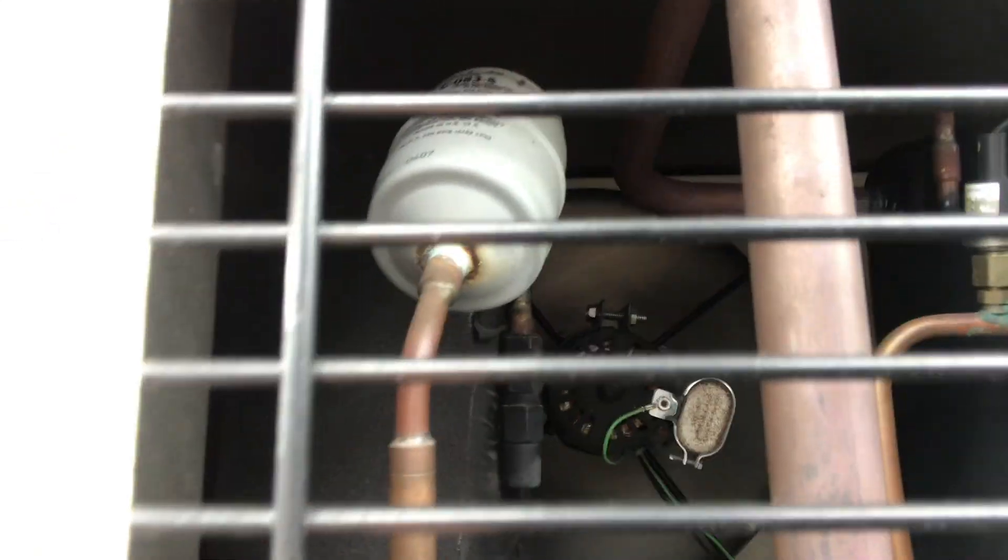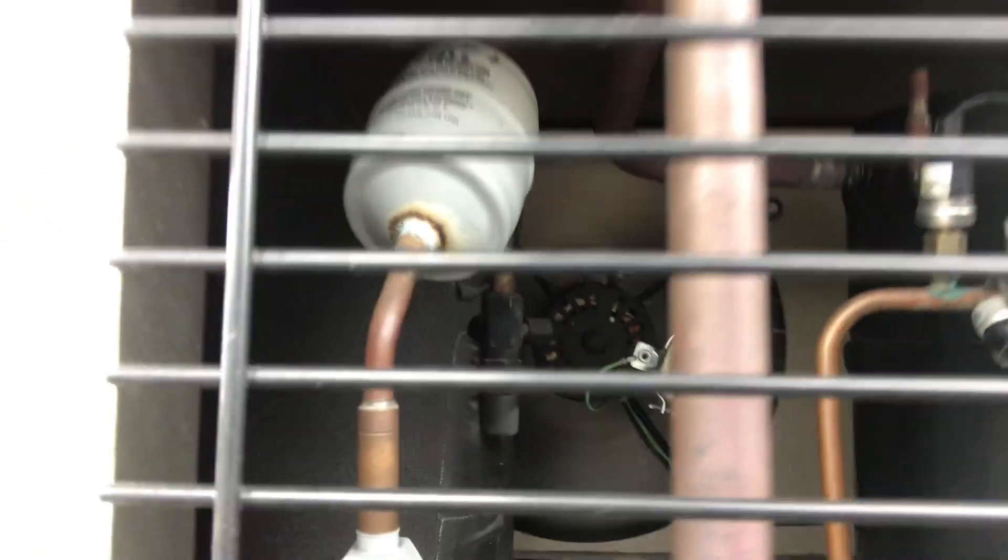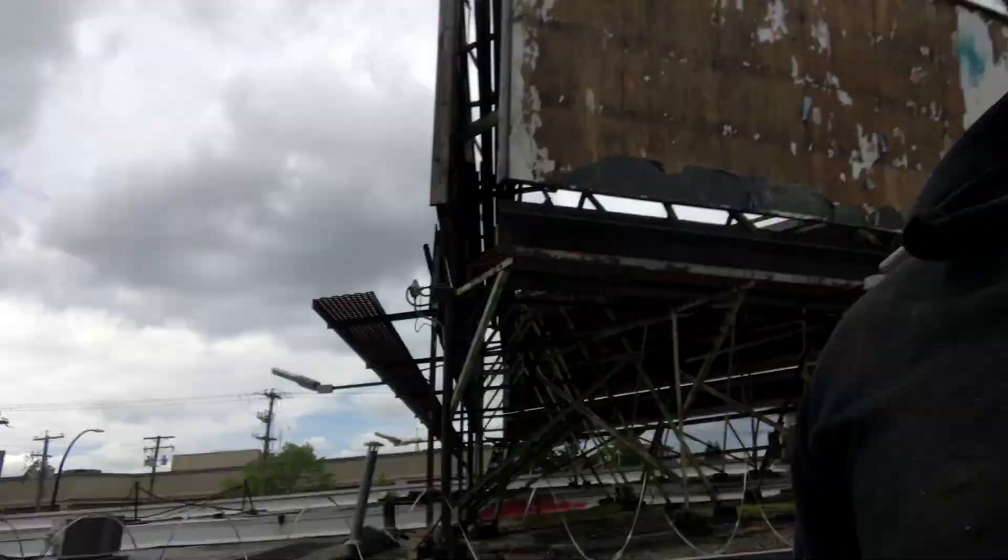We're going to be using it on — you guys can see — the side glass there is not full, it's bubbling, so we do have a leak. I was here about four months ago, put refrigerant in, and now we are back to square one, so there's definitely a leak and it's fairly big I'd say. We're going to test this product and see if we can find the leak.